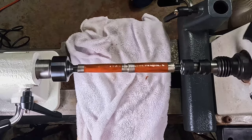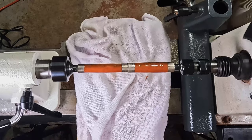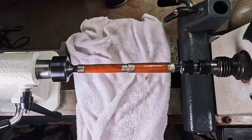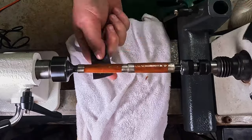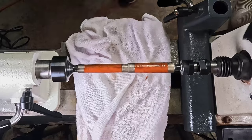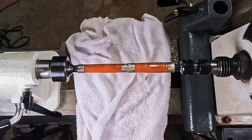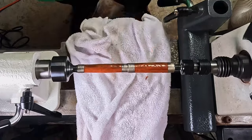You might notice that I'm using some accelerator just to speed up the curing process of the glue. The black foam you might see — that's EVA. What I found is it doesn't actually stick to the superglue, so applying it with that allows me to get a lot more layers before I have to swap it out. I can just roll it over and use the back, turn it around and use the bottom — I can usually do an entire pen off one of those little squares.